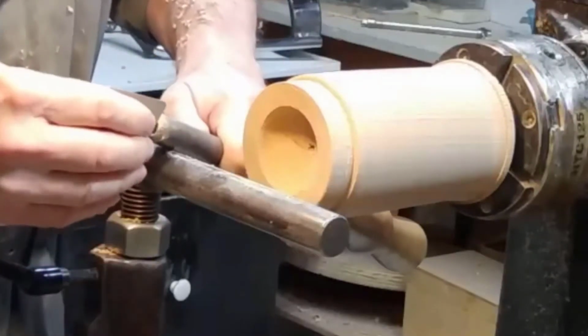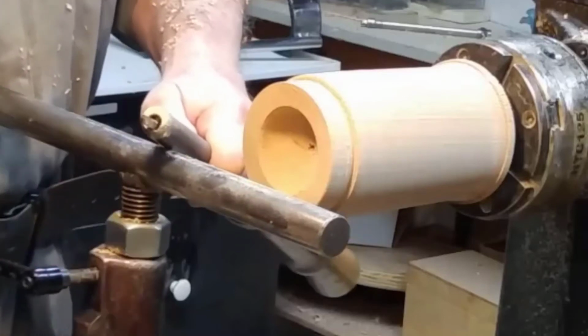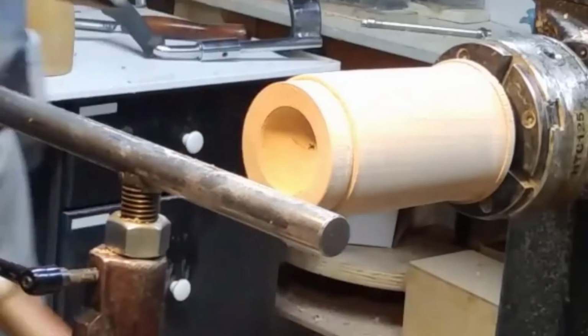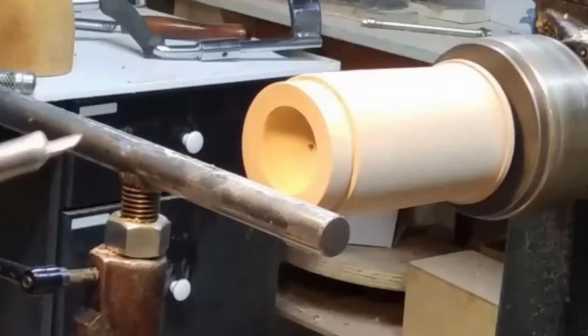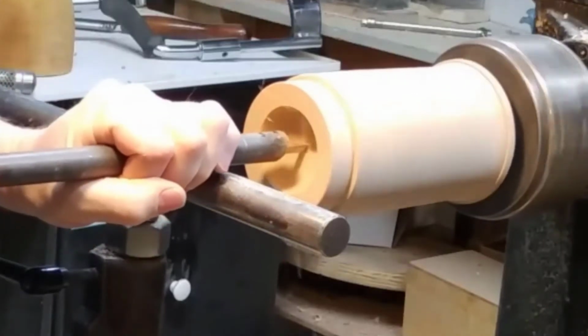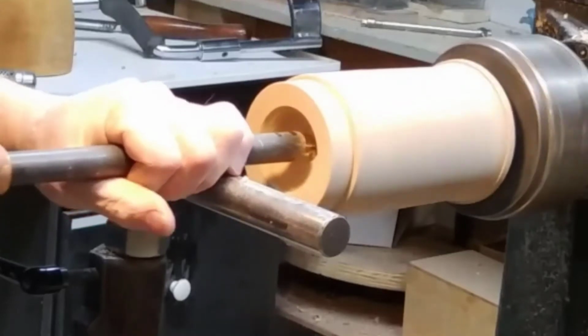It's not the greatest view, but I usually hold the tool upright, vertical, rather than at a 45 degree angle. But basically, I'm practicing. I'm getting better at honing. Not perfect. I could probably hone to add the burr back on these cutting tips maybe 3 or 4 times before I remove the tip and take it to the grinder and get it really nice.